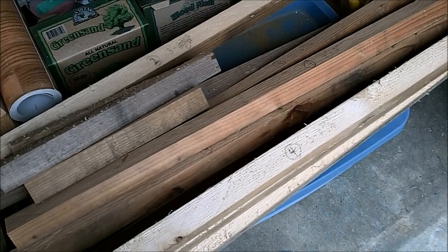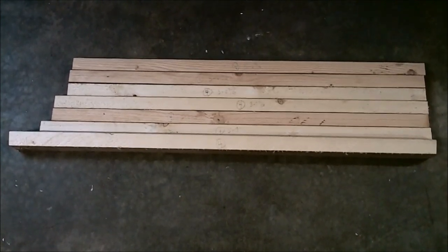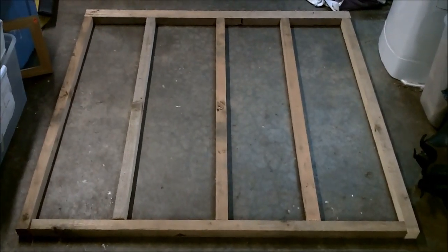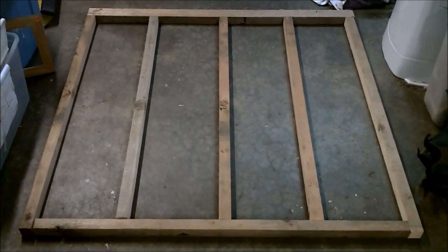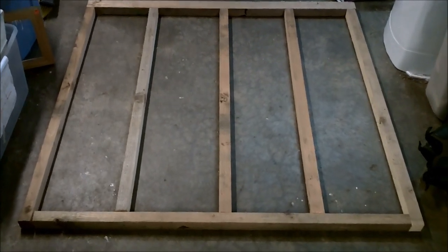Now I'm going to move to the construction of the back wall. I'm going to assemble the back wall now — I've labeled the boards with their individual dimensions so I can piece them all together. It's raining and cold outside so I'm assembling this in my garage. I'm going to pre-drill all the holes and then use three-inch wood screws. Because of the thickness of the header I'm going to pre-drill and also countersink so that I get the three inches of penetration that I want.